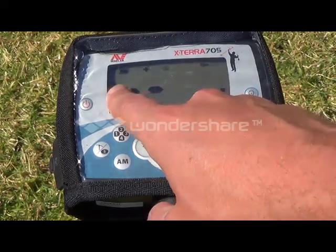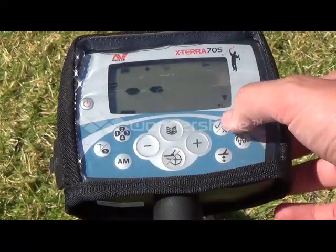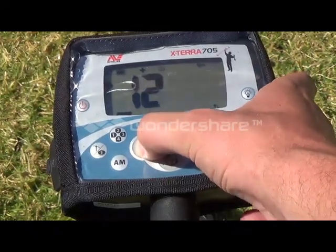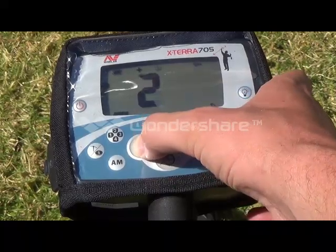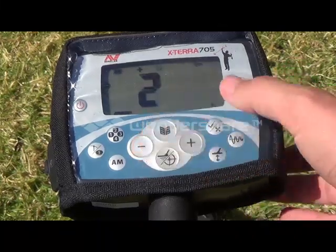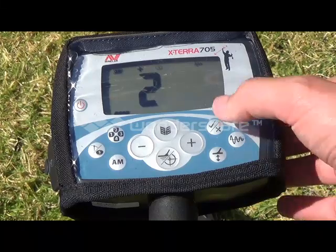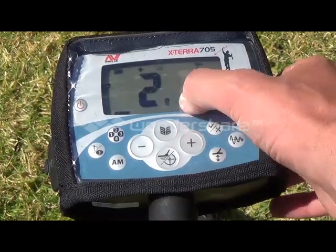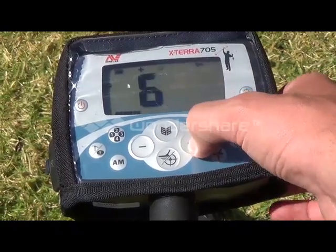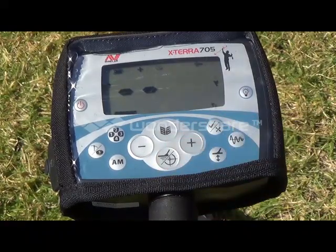with your presetting from Minelab of discrimination, you can actually press the tick or cross button, and that will allow you to go up and down in the target ID, and say you don't want the target number 2 to be audio sounding, you can simply just press that button again and the little trash can pops up to show that it has been discriminated against. To exit out of that, simply press the pinpoint mode twice and you're back.